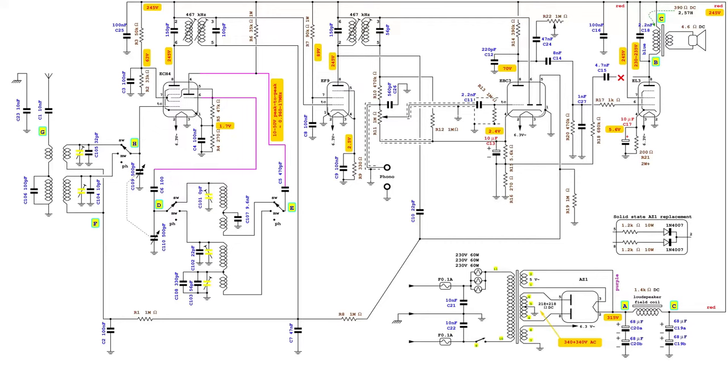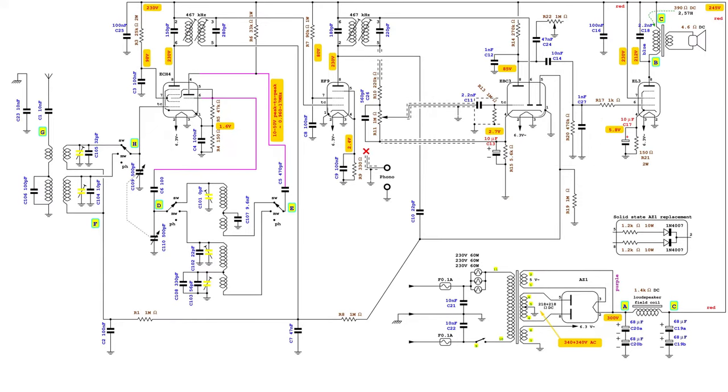In the meantime, also the connection of the RF module was corrected, and the module itself was modified for getting an alignment using only fixed-value capacitors. But at this stage, the value of the capacitors used for the intermediate frequency transformers were wrong, making the radio very poorly sensitive. Therefore, the radio underwent another modification phase with the purpose of increasing the sensitivity, and only later the problem with the IF transformers was discovered and corrected.